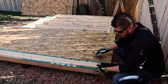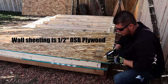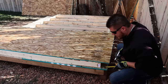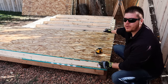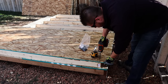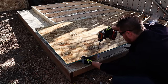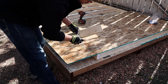When skinning the wall first and then standing it up, we've got to make sure we account for our joist material down below as well as our floor material. So I've got to hang my board off four and an eighth inches. I'm going to hang it off exactly four and an eighth — it's not rocket science. Then you can drive in a screw, hold this corner, measure your second edge, drive in a screw, hold that corner, and go up and measure an inch and a half longer at the top for your top plate, cut everything to size, and stand it up. One nice thing about this method is I pin the closest corner and measure and pin the far corner — that squared the wall up. You can see when I push and pull on the plywood, it's actually moving the wood frame below it as well. This is basically going to square the entire wall up with the factory edge of my plywood, and everything is self-squaring from that point.